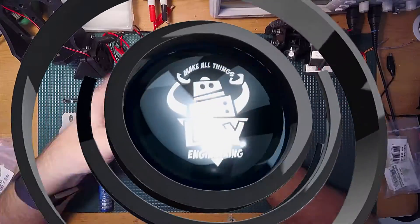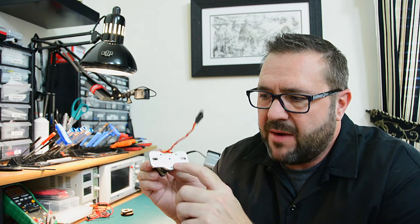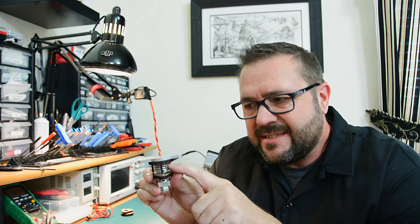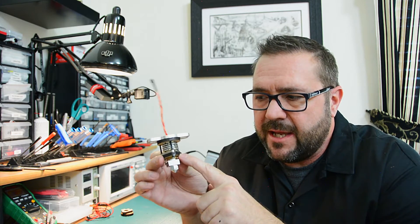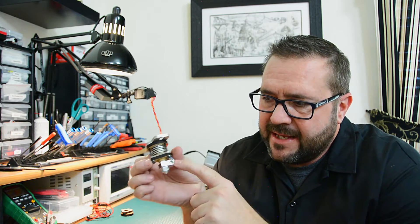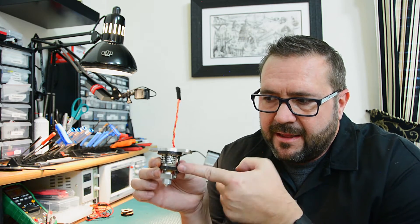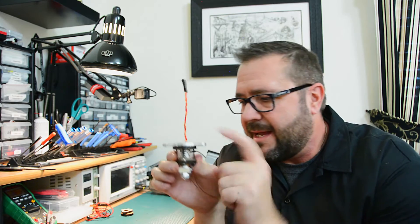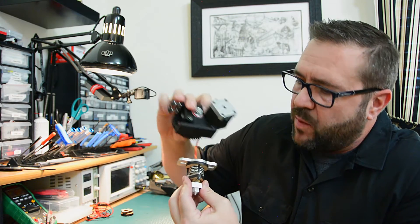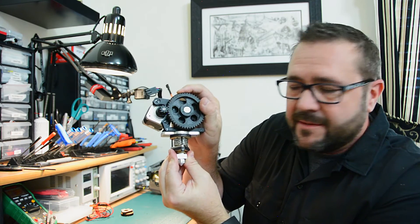That's the finished product. It was pretty straightforward to assemble the hotend. If you look at the construction, the top mounting plate has a hole for the three millimeter filament to go in — filament goes down through a PTFE tube where the heat sink washers dissipate the heat. Once it gets down to the stainless steel plate and goes through the lower wooden plate, it goes through a threaded extension, you see the heater block and the nozzle. Anything below the lower wooden base plate is considered the hot end; anything above that is the cold end. That's why you have the dissipation and the PTFE tube to keep the heat away from the mounted side. Ultimately this gets attached onto a Wades extruder, and this gear drive actually feeds the material down into the hotend.